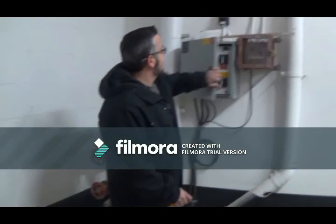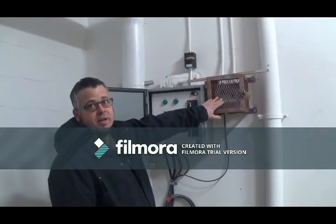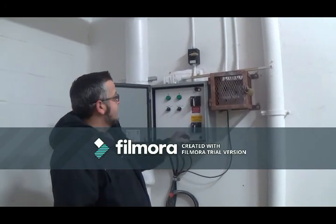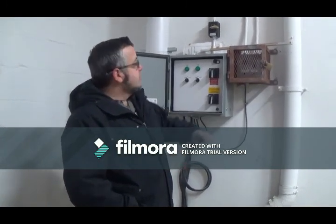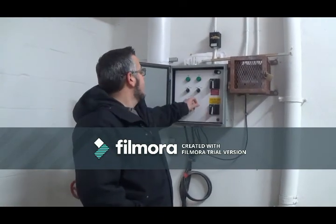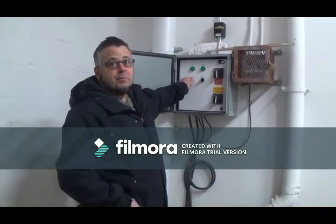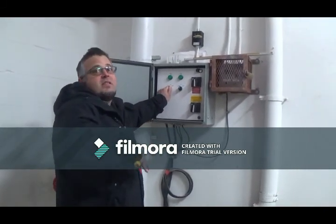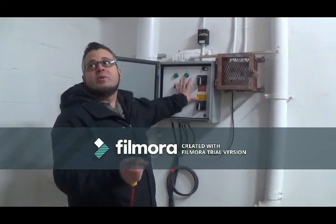With two pumps, you have a 600 volt control panel and a 120 volt alarm panel, which is wired to your BAS. It's all run by a four-float automatic system. From the bottom, float one is your stop float, float two is your start, float three is your boost, and float four is your high level. For the system to activate, floats one and two both have to be up, and then one pump will kick in. Then it shuts off, and on the next cycle the second pump kicks in. It always alternates, so one pump isn't doing the full load.